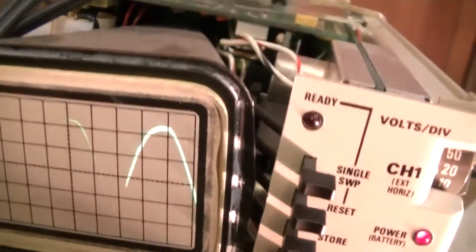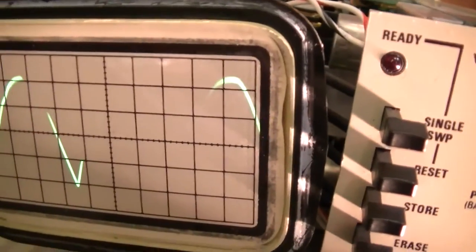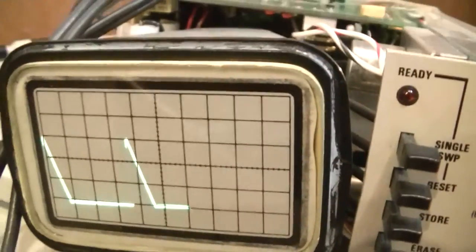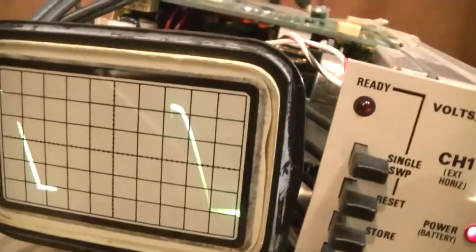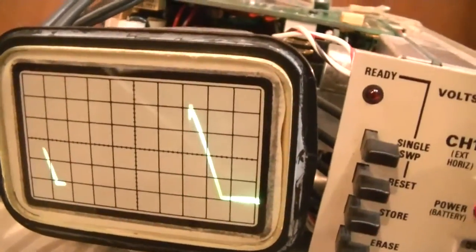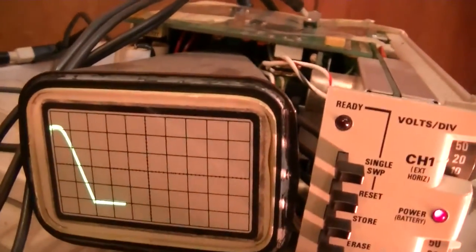So the more of that sine wave you have, the brighter your light is going to be, or the faster your motor goes. So as you can see, when I turn that down, now I've only got part of that wave actually showing up. Let me turn the brightness up on this oscilloscope. There you go. So see how that works? That's pretty cool. So that's just those SCRs turning on and off.